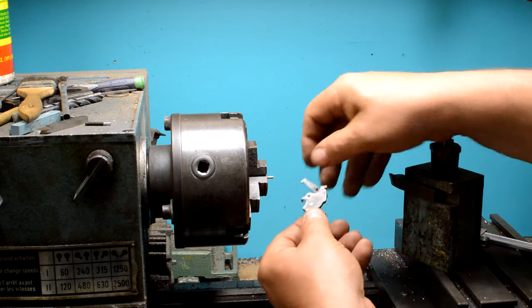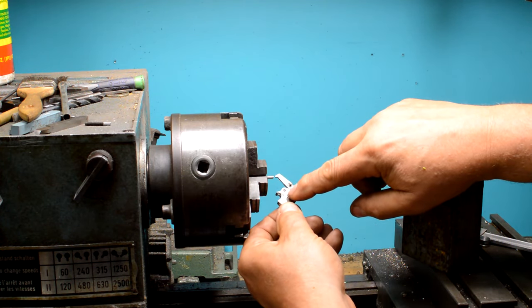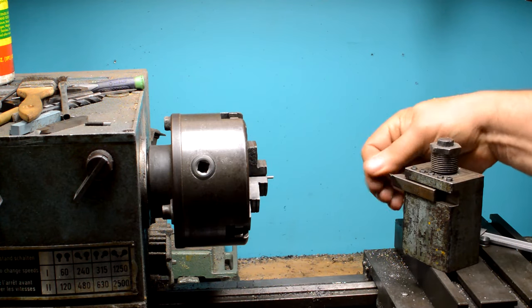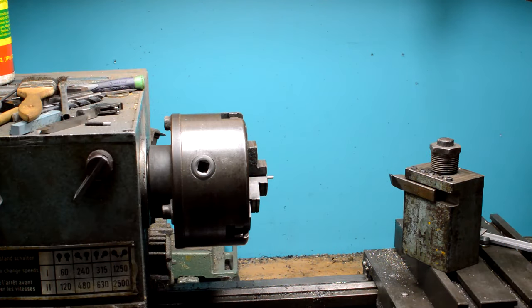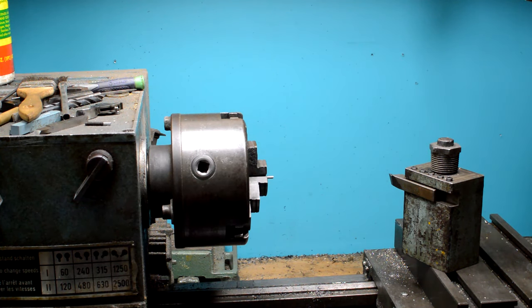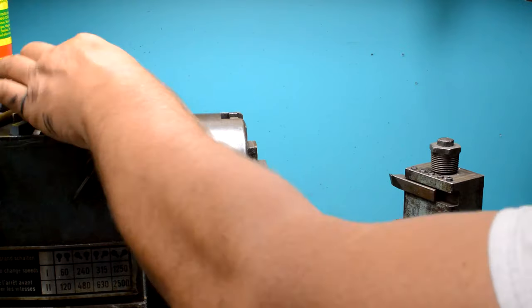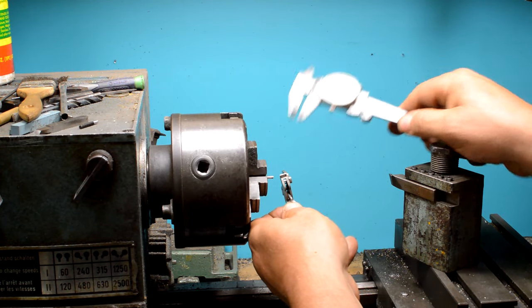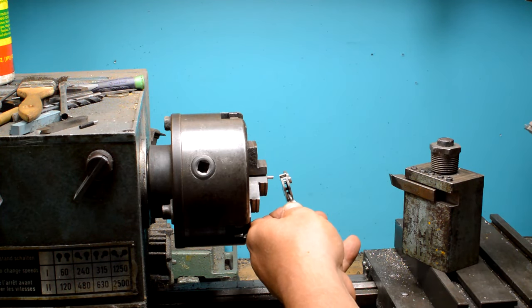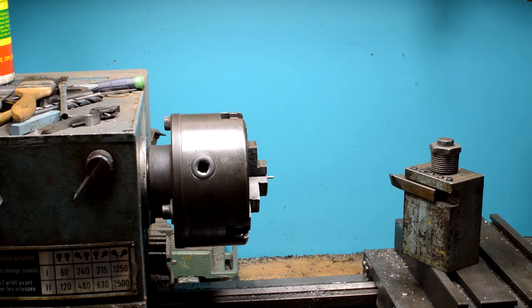Test fitting this, because this gun had a lot of strokes on it, and that hole was walloped open about maybe 5 or 6 thousandths of an inch. So even though the pin mic'd at 100, I'm going to about 105 to try to take the walk out of it. Yes, it does turn this Model 29 into a one-of-a-kind gun, but as I'm going to show you in a couple of seconds, where that trigger is sets where the single action sear meets. So what we're doing with this pin, it's an integral part of the safety of the 44 Magnum while it's at full cock. We'll get to that, but in the meantime, I'm going to finish fitting this.